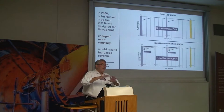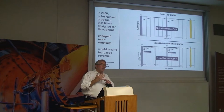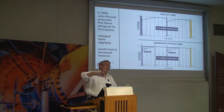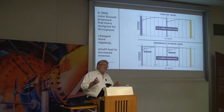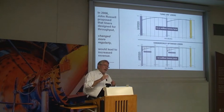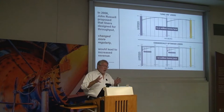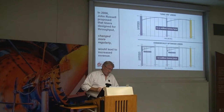I know of at least two mechanisms that help more throughput with thinner liners. First is an increase in mill volume — if you have liners that are 600mm deep, which is pretty common, your 40-foot mill is really a 36-foot mill. Second, as liners wear and lose their profile, you can touch up the mill speed a bit without balls throwing beyond the toe of the charge. In wear and abrasion situations, an increase in sliding velocity for fine particle creation is to the third or fourth power. Tweaking mills from maybe 81% to 83% critical gives a minor increase in sliding velocity of the charge.